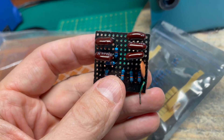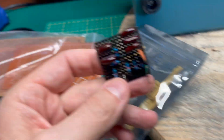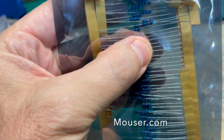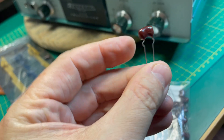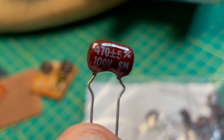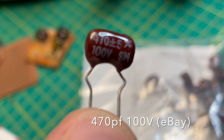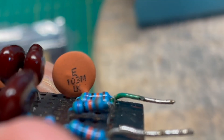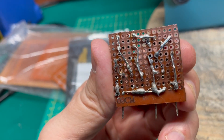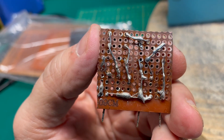I spray painted one side black — I just thought that was a little nicer than all these lines. Got some quarter-watt 470K resistors and a bunch of these 470 picofarad micas. I think I got these from Mouser, or possibly eBay — you can still get these new old stock. And there's a 0.01 ceramic capacitor there. The business side of this is not very pretty, but basically I just did point-to-point wiring on it.